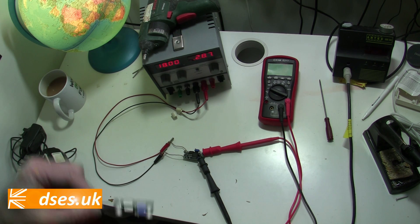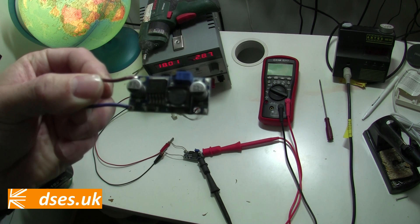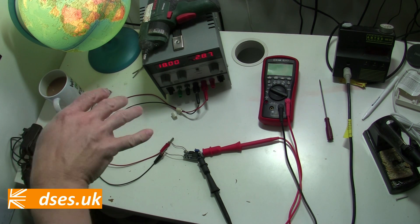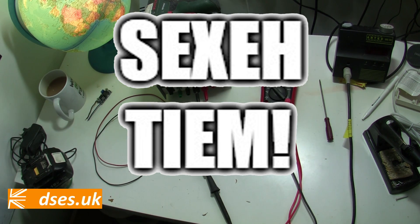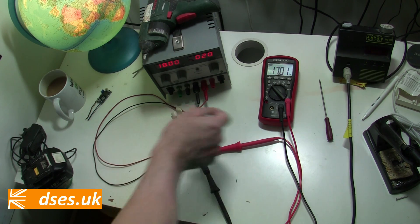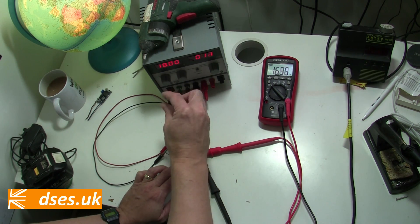What am I blabbing on about, you may well ask? Well, here's one I nabbed this week from Amazon — there's a link in the description for those interested. This is a DC to DC step-down converter, and the nice thing about this is that the output voltage is adjustable. I've set one up here on my bench power supply, and I've dialled that up to provide about 18 volts to match what my Makita battery would supply. On the output, I have my TIS-E217 multimeter with its patented SEXY TIME backlit display. So let's switch that on: 18 volts in, 17 volts out, and by adjusting this potentiometer, I can set the output voltage to a value of my choosing — in this case, a nice flat 5 volts. Lovely stuff.